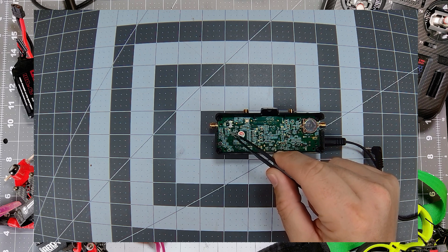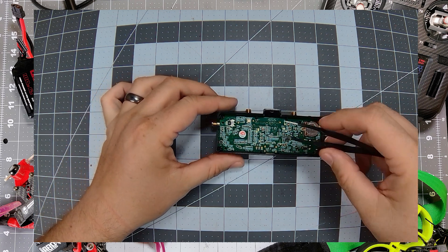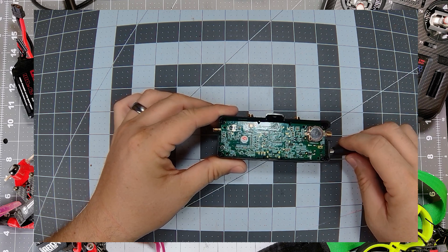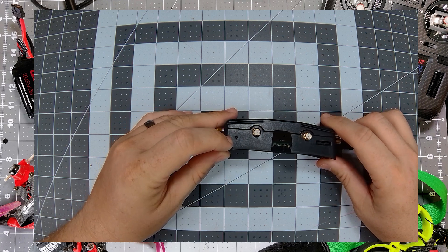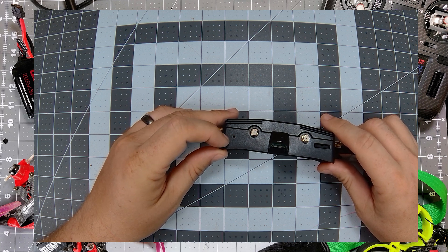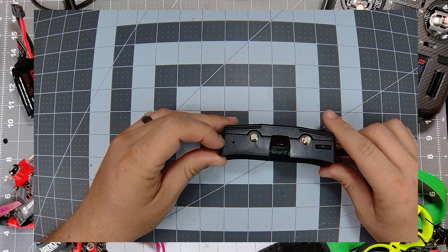The light is now off for the second time. So we're going to disconnect power from the VRX, wait for the fan to stop, and then slide the switch back into the top position. Then we're going to boot the VRX and hope we see a red light on top. You should see a red light here if the VRX is going to power up. Doesn't look like it's going to do it — looks like our VRX is still in trouble. If your VRX powers up and the light comes on, then you're good to go. Looks like we're going to have a little more work to do though.